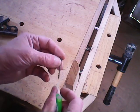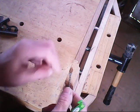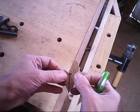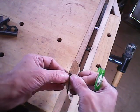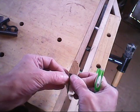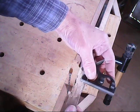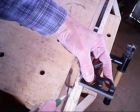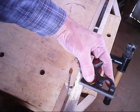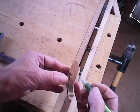The first thing I'm looking at is that I want the screw to come down with the head countersunk. So the first thing I need to do is look at where I want the screw to come down through, the sides of the screw that I'm going to be using, and I want the screw head to be countersunk. The second thing I need to do is put a straight edge across the back side and make sure that screw is not touching the straight edge. If it is, then I have to adjust the screw angle. When I'm satisfied with the angle of the screw, I'll go ahead and mark where it's at.